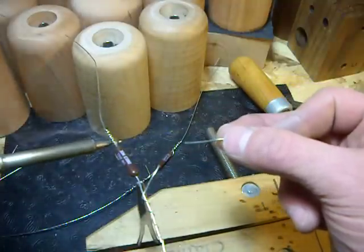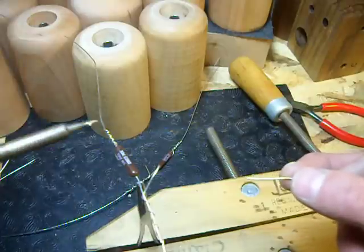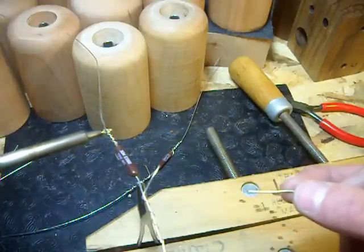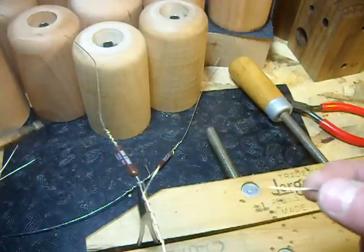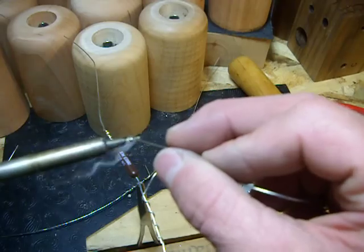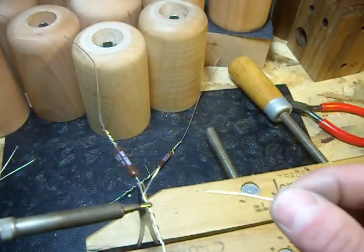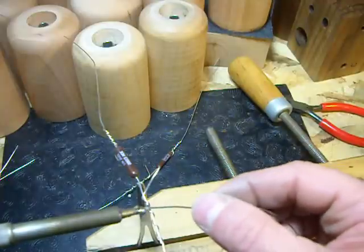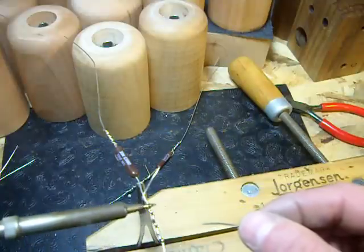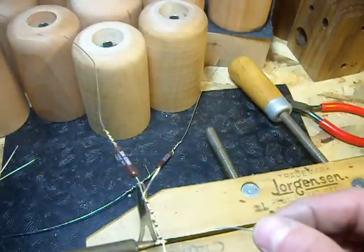Make sure the work and the solder both are well heated. I applied the solder from the top; you can remove solder from the bottom. If you have any excess, gravity will put it onto your soldering iron. Wear safety glasses — this solder can splatter. Add more solder to wet the tip.